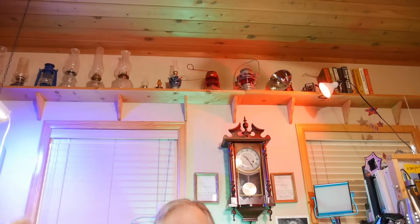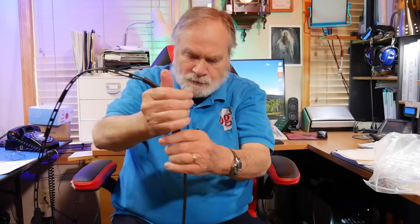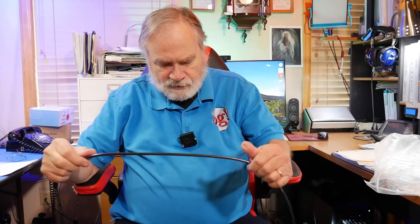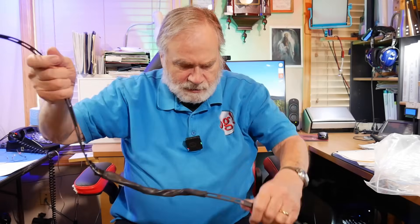This antenna is not meant to be atop a tower — it's meant to hang from a tree. The reason is that it's made out of a piece of transmission line. The feed point on this is balanced, so you should put some ferrite beads right here, or wrap a bunch of coax together. Ferrite beads are probably cheaper, because 10 turns of coax is about $25 worth of cable — probably more than the Slim Jim cost.